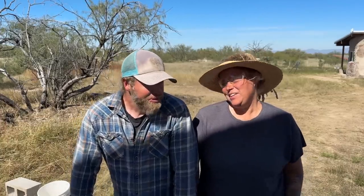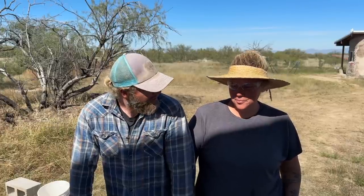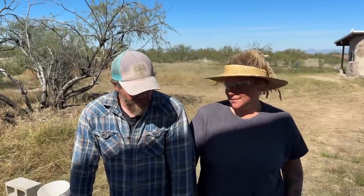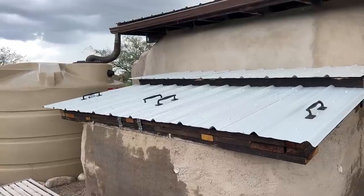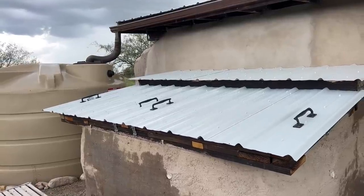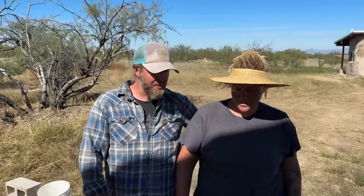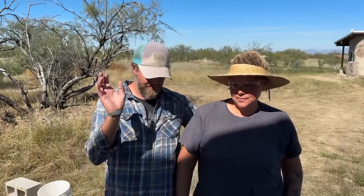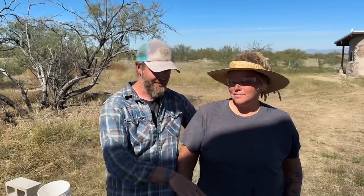Well, yeah, that's version 3 of our solar powered pump house. Yeah, we're trying different pump houses each time. This one's pretty similar to the first one now. We tried the earth bag thing on the chicken garden. It's too big. Way overkill. The whole roof ended up being ridiculous. So we're going to pour a proper pad underneath. Not just lay some bags, we're going to actually build it up underneath. We're going to put in a drain so that if water ever does leak inside there, it'll come out the side. All right, ready? So I guess we gotta go look at our wood situation.